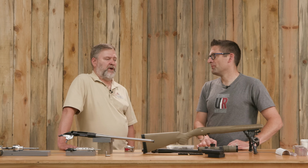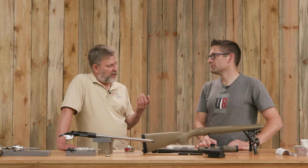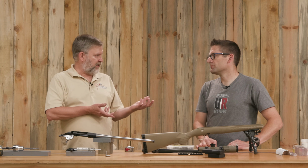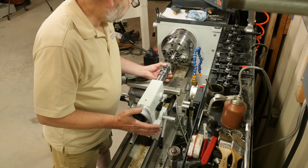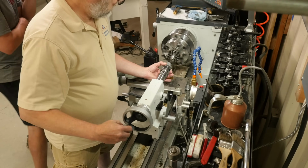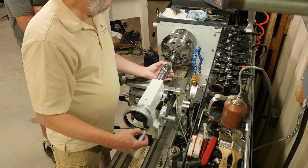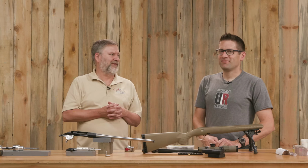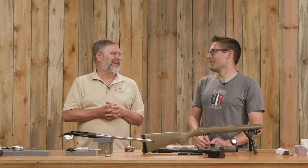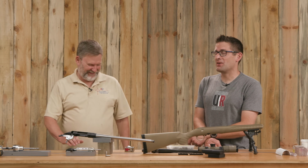Basically I'm just watching for that, feeling for it. Take a slow cut so that you can make sure it's smooth. And you do have to load the reamer enough so that it's actually cutting smoothly. If you try to go too soft, that's not going to work. You're going to get chatter, you're going to get wear on the reamer. Just like parting on a lathe. If you don't part with enough feed, sometimes you get breakage of tools, all sorts of problems. That's why I like to power part if I can. It's a leap of faith sometimes. When those big chips are coming off, you're like, oh, I hope this works. Especially on a lighter lathe.